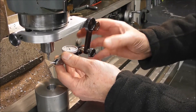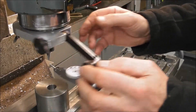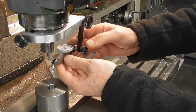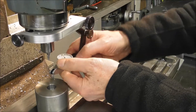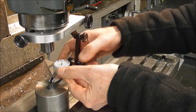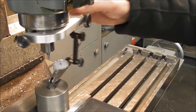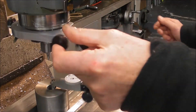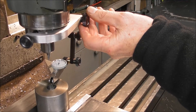Another thing I did was make it with adjustable friction joints, so you don't have to fiddle around tightening and loosening the adjustment screws. All you need to do with this design is just tip it into position, bring it into contact, and there you are. Quick as that, you can check the concentricity — or the lack of it — and you can see the run out and adjust it until it is concentric.